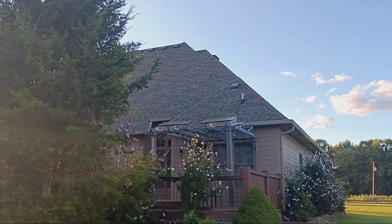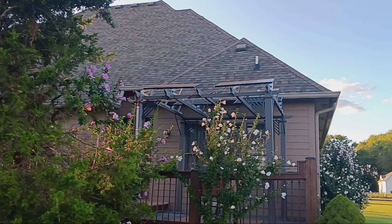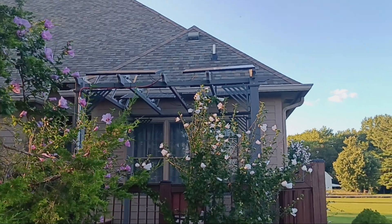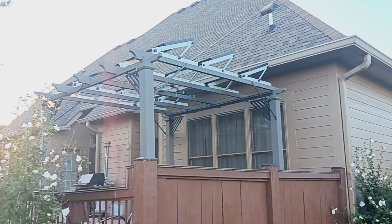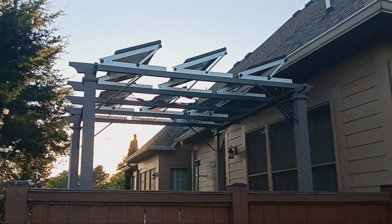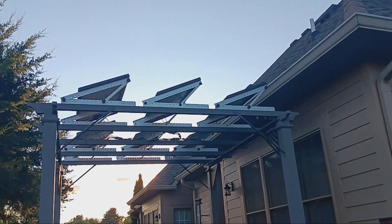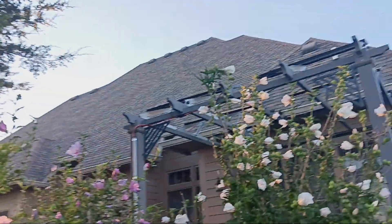This is a follow-up video on my solar pergola. As you can see, there are six 100-watt panels up there, all running in parallel. I know a lot of people have told me it's probably better to run those in a combination of series and parallel, and they're probably right, but it seems to work for me so far. On the best sunny days, the EcoFlow units are showing anywhere from 250 watts up to 290 watts. It's about 8:30 and it's August right now, so I'm still pulling in 30-50 watts, but it is later in the day — it's dusk.